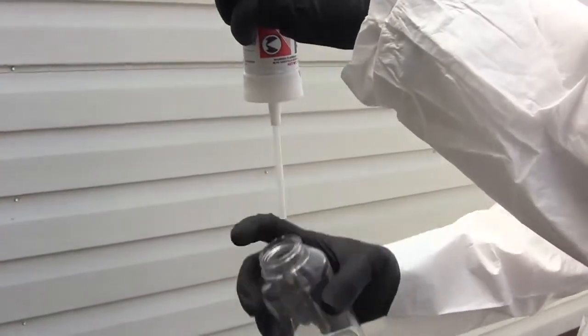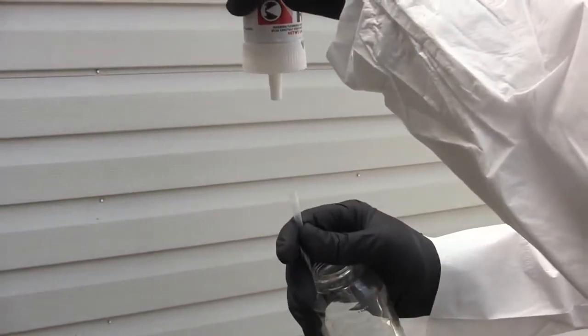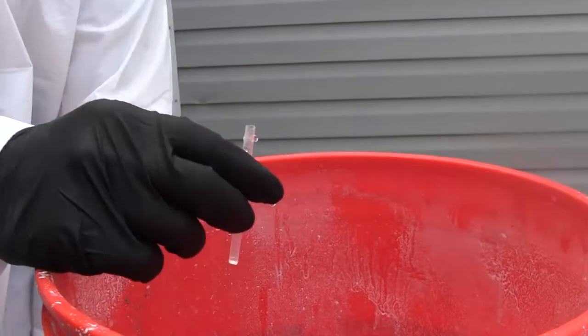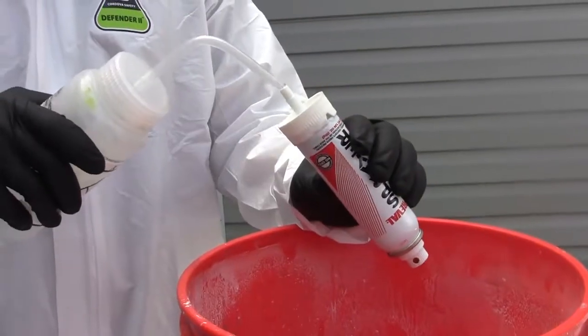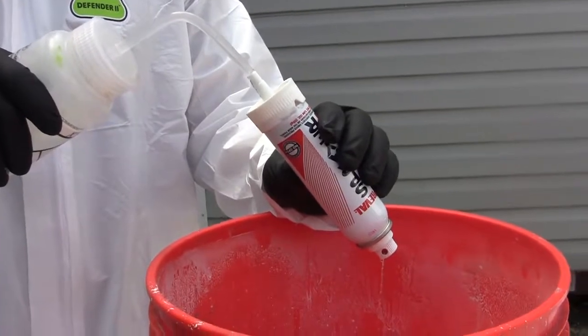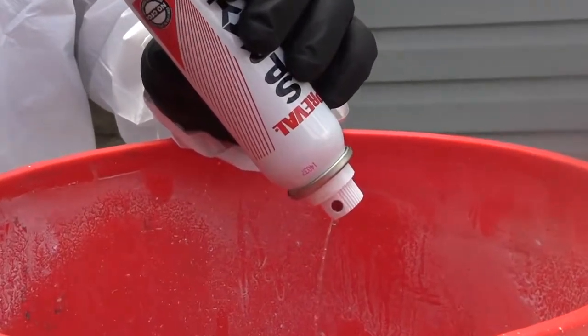Remove the power unit from the Ultra Mini Sprayer and separate the fluid intake tube from the power unit. Rinse the inside and outside of the intake tube with xylene and wipe it clean with a rag. Holding the power unit upside down over a waste container, run xylene through the intake opening and allow it to gravity flow through the sprayer nozzle.